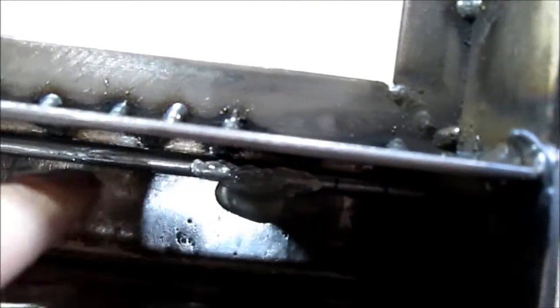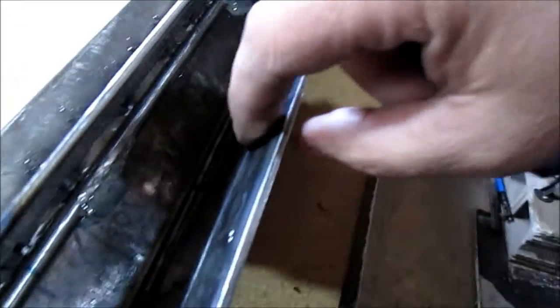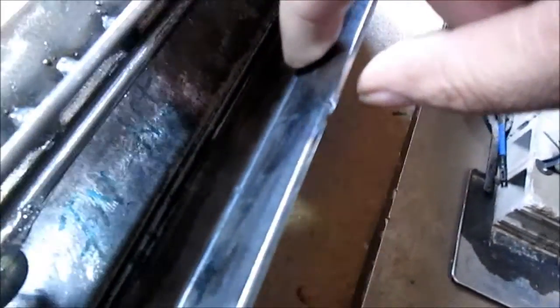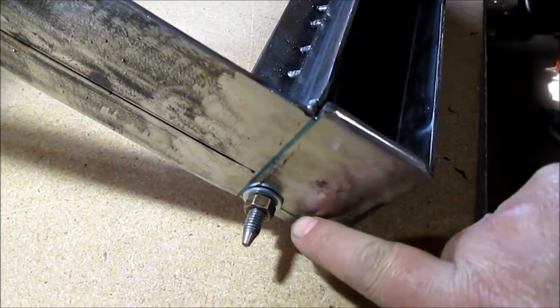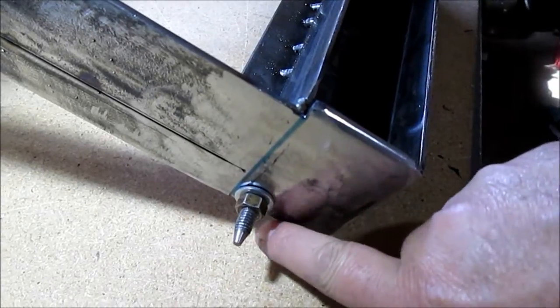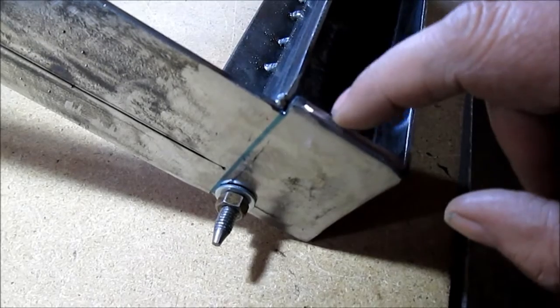There you go. We're going to take the MIG welder, we're going to put some spot welds on there. We're not going to weld it completely, we don't want to warp it. We're going to have a spot weld on the ends, several locations. And we'll have pictures of how this went together, where I made this wider. If you can see the split there. I had to make this 1 inch longer because this is 1 inch, this is 2 inch, so we had to make it longer. It's a 2 inch piece of angle and comes down this way with the holes in it. This is 3/16, just whatever scrap I had.